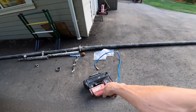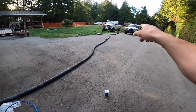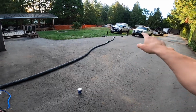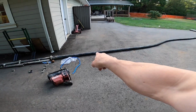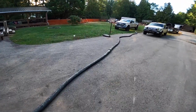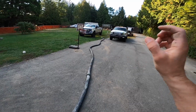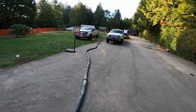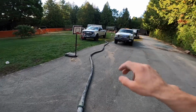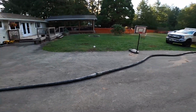I'm going to have a guy back here running the compressor with a radio, and a guy at the end of the hose with a radio. The guy at the end of the hose is actually going to start right back here, and he's going to follow that sponge along. What he'll do at the very start, he'll start at the end of the hose just to make sure the concrete is actually moving, and if you have a third guy handy to hang on to that hose while you're chasing the sponge, even better. But you can do this with just the 2 guys.